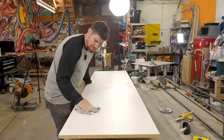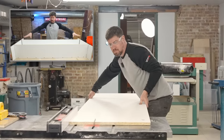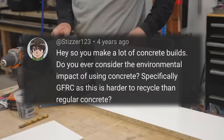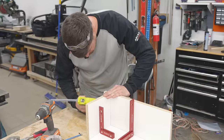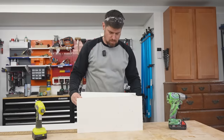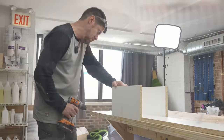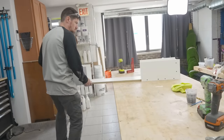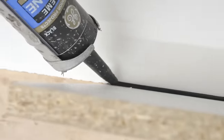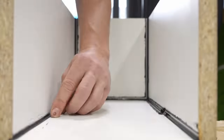With the rebar frame done we turn to the melamine form that we're going to pour the concrete into. Last time I just made a big rectangular box, but this time I wanted to reuse pieces of melamine from previous concrete projects. I get a lot of comments about the environmental impact of concrete projects, and saving and reusing melamine is a little thing I can do to reduce that impact. This made it more complex, so I made two open-ended small boxes at each end of the form and left the middle open. Now for another episode of caulk talk: I apply a layer of paste wax to the melamine, lay down a generous layer of 100% silicone caulk, and run a metal fondant ball tool over all the caulk lines. The tool pushes excess caulk to the sides, leaves a clean line over the seam, and the paste wax makes it easy to peel the excess caulk away — leaving a perfect caulk line.